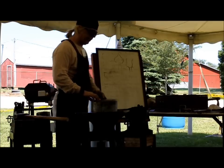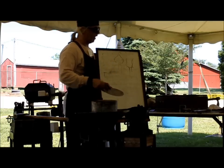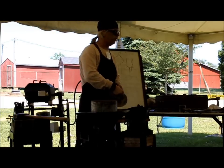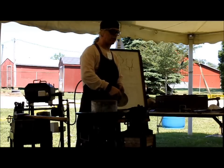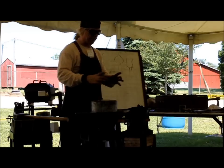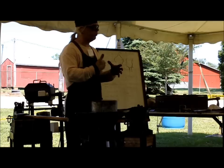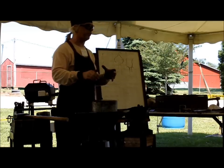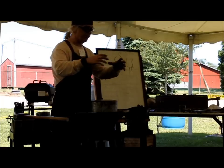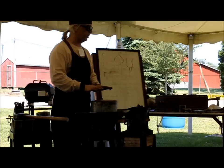What I will do with this, like I did with the small wax catchers, is I'll start on the outside and spiral into the center, and then I'll come back out, spiraling in and out a couple times. And then at home I have a big piece of round stock that I had a machine shop dish out the center of for me and face the other side flat, that I use a lot of times for flattening the bowls. Even if it doesn't fit over it, having the flat surface to drive down on is very helpful.